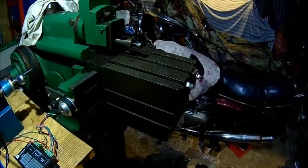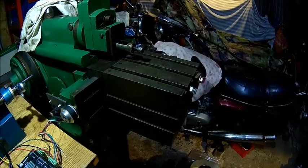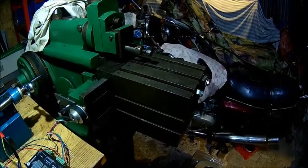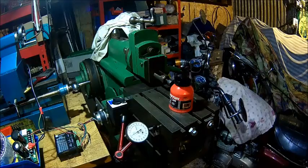We had it all rigged up and ready to do our first movement and see what it does. We know it's a bit stiff in places, but that's the shaper — it probably needs a bit of scraping on the ways because it gets really stiff towards the end. So we're playing a little bit with the repeatability. The stepper motor is just one I had and I'm not really happy with it because I think it needs a little bit more torque. If the machine is cold it's losing steps, which I was expecting.